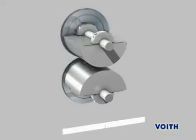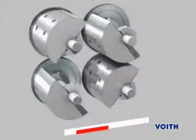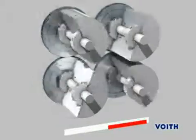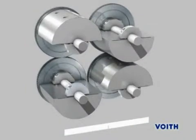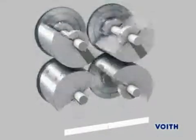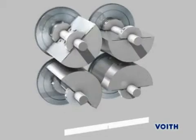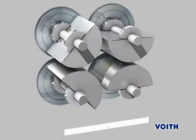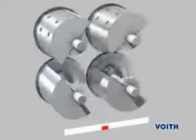To control the stroke, the Duo Shake has a second, identical pair of masses. The length of the shake stroke is determined by the summation of the horizontal components of the centrifugal forces. When both unbalanced mass pairs run with all the mass in the same direction, the stroke is maximized. If the weights of the second pair are rotated 180 degrees, the forces cancel each other and the Duo Shake comes to a complete standstill regardless of motor RPMs. Between these two limits, any desired stroke can be set by changing the angle of the weights. In combination with the rotational speed via the variable frequency motors, you can adjust the optimal shake coefficient for your product and achieve excellent results.